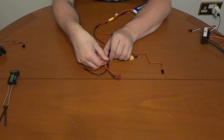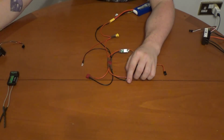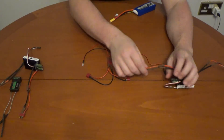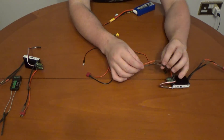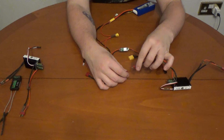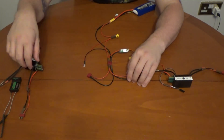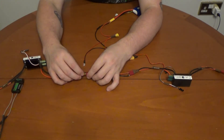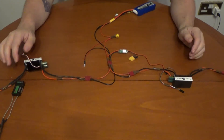So we do this — it's connecting there. And now the speed controller. There's a little bit of a difference in wire thickness here, but it's holding. A little extension on the black, extension on the red, and that fits in that side there. Same in here — red into the red, black to the black. And there we go.